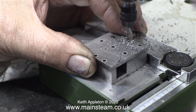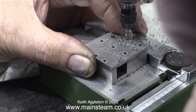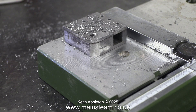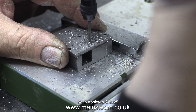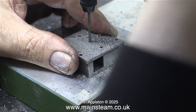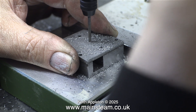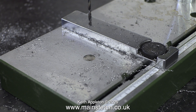This is a very nerve-wracking job. So far, a big slot's been milled down the middle of the block, and that's bad enough — I'll have to do that again on a new piece of steel. The problem is, at any time, if the drill bit snaps off in any of the holes, that is bad and the part is scrap. And once it comes to the threading part, using a 6BA tap, that's really going to be nerve-wracking, because it's very easy to snap a tap off in the hole, particularly a small one. With this job, you need to be firm but delicate at the same time, and this is quite difficult to achieve sometimes.